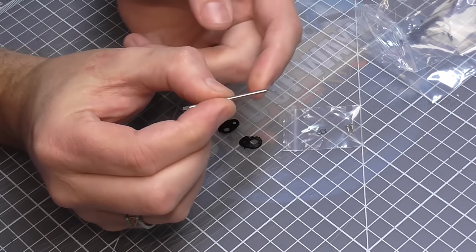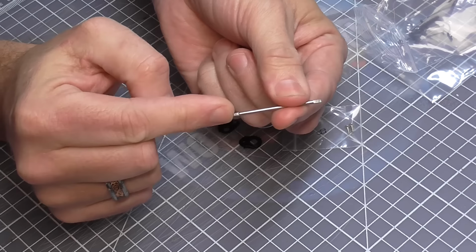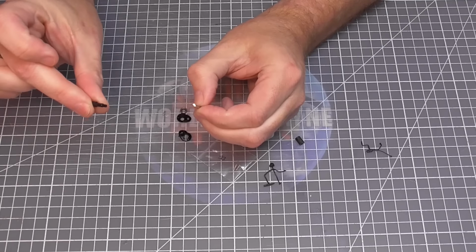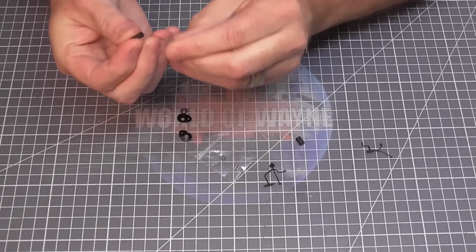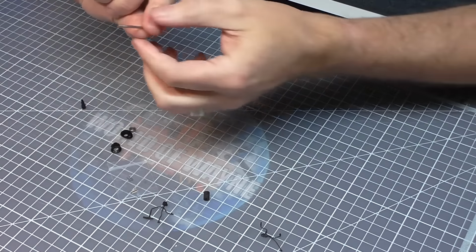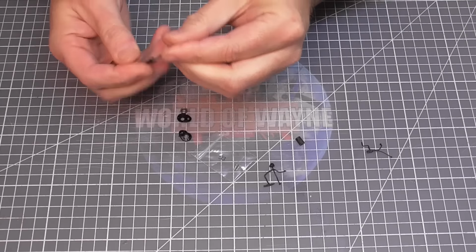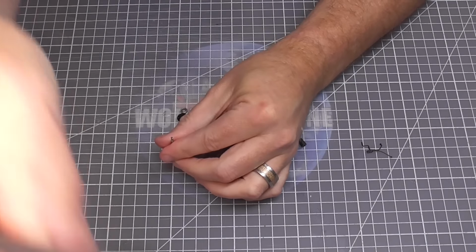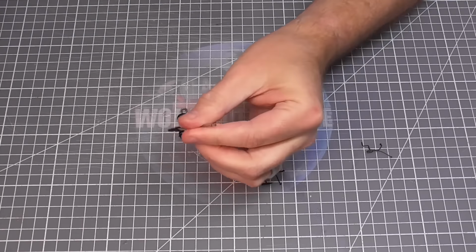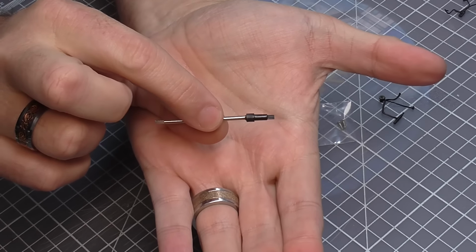And the first thing to do is on this metal rod here, we've got a long end indented and a short end indented. It's the short end I want, and I'm going to be putting into place this cap right here. Now, it is a D-shaped pattern, and it needs to go all the way down. So I'm going to drop that in a tiny bit of oil just to help get this in. And then what I'm going to do, got my hammer, I'm going to give that a bang. Not a lot, just so that that's in all the way and it's flush in there.